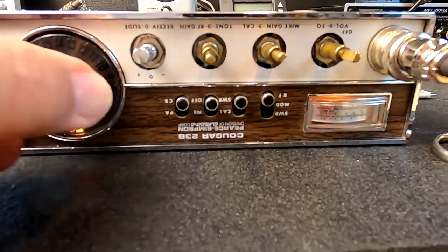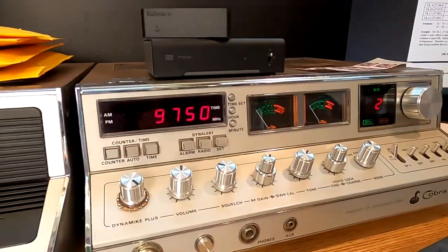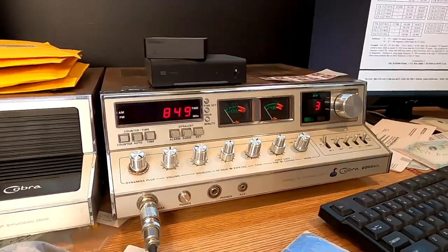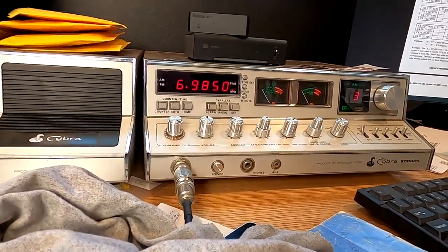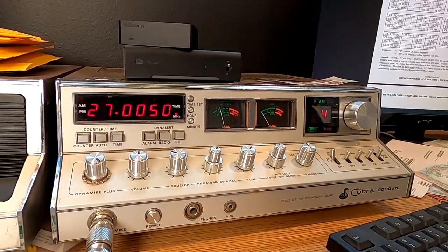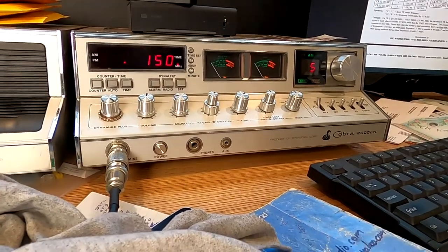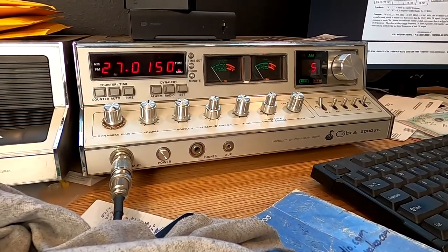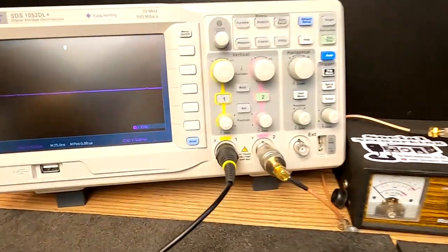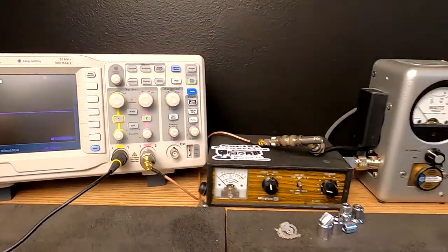So we'll just check this. We know that our channel one's right, so channel two is going to more than likely be right. There we are on channel two. I'll go channel three... all right. We're going to go with channel four — on the radio down here and on the monitor CB, we've got signal there. So here's what happened: we go to channel five... it's gone. This should be transmitting on 27.015. Where are we transmitting? We are transmitting on 27.0038. So yeah, we're a ways away.